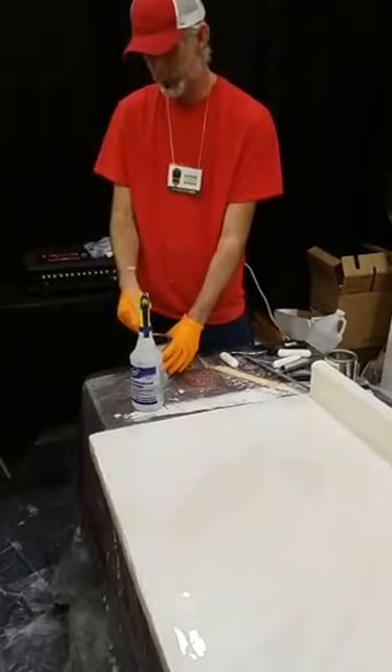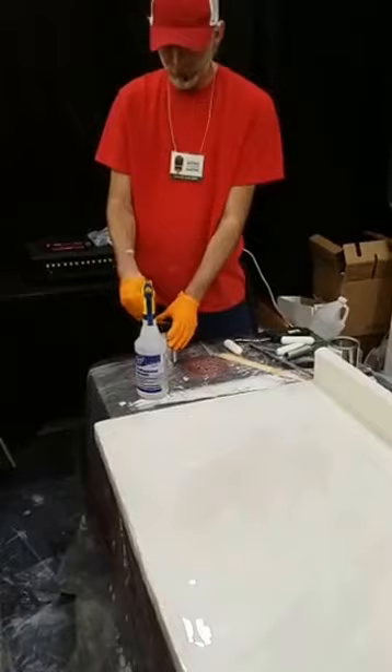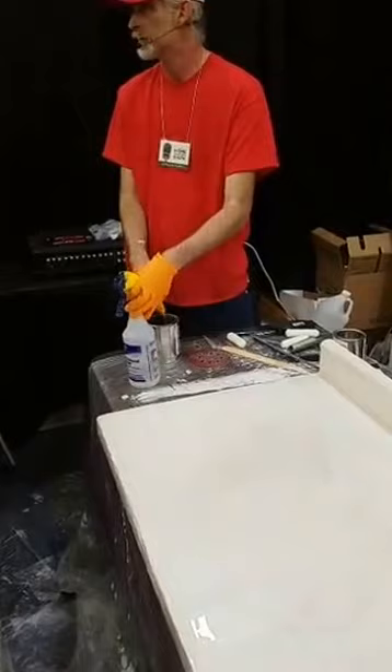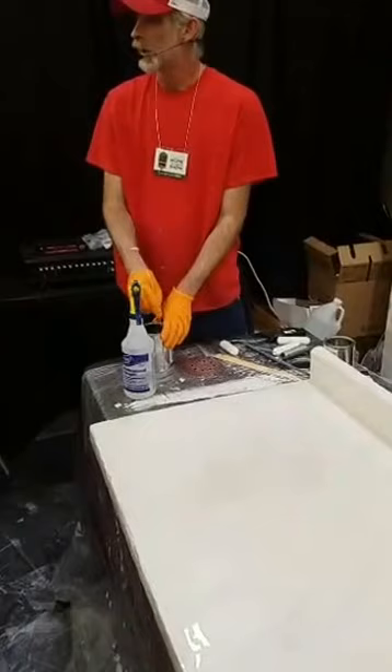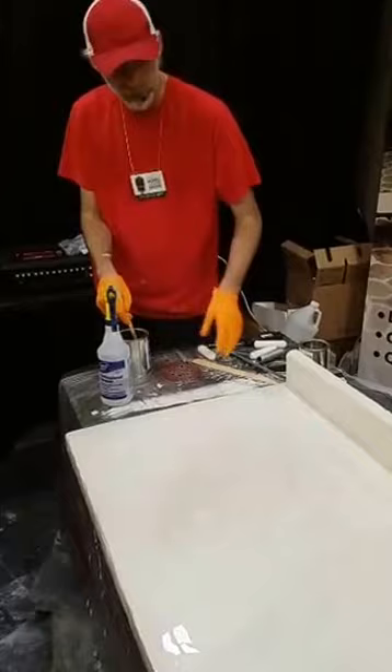As this goes off, concrete is just like a sponge — it has holes in it. This creates heat and helps air rise, so you start seeing little air bubbles form. A lot of times you can use a heat gun to go over that. I've gotten to where I'm actually starting to mist with acetone — it's cold on surfaces and it pops the bubbles. That's a good tip — listen in on that. Also, the acetone reacts with the epoxy and gives you a little bit longer working time. So if you have a mishap — like a fly landing in it — you can pick it out.